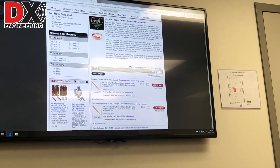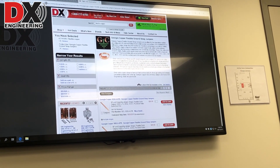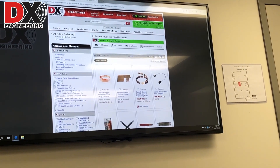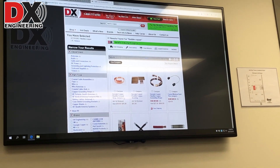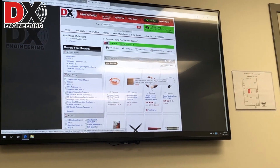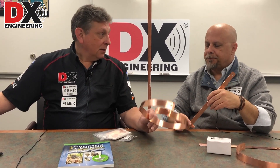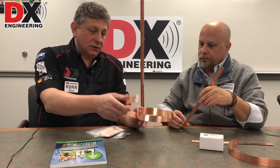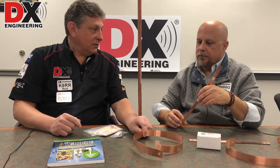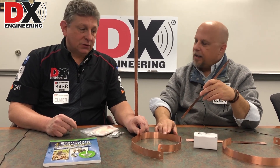How do you find these? Search 'flexible copper' and you'll get to a page where you see these flexible ground strap jumpers and also the standard flexible copper ground straps. In a lot of cases you would use inch-and-a-half or two-inch wide copper strap for a main grounding bus, but if that's too wide, this flexible one-inch wide pre-cut strap with holes punched is much better than anything else.